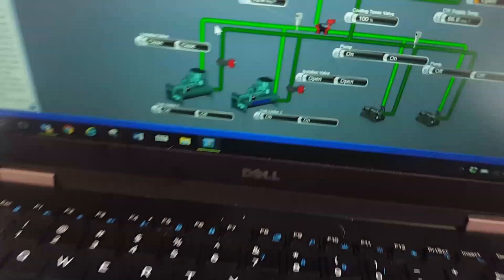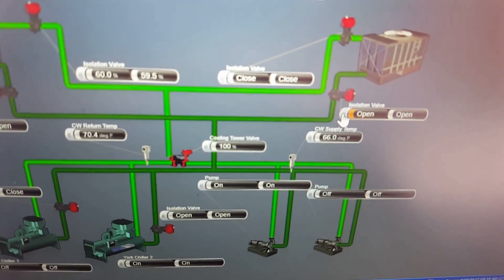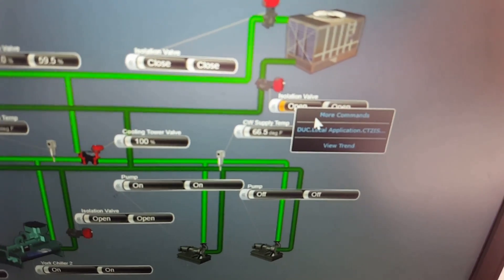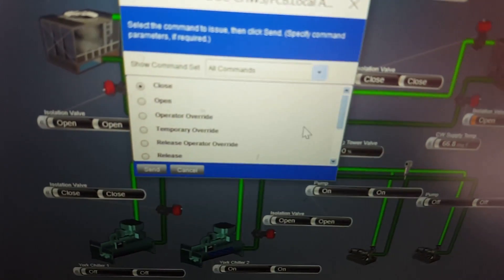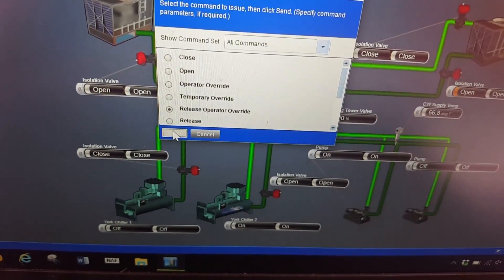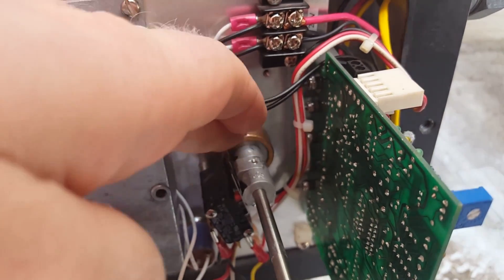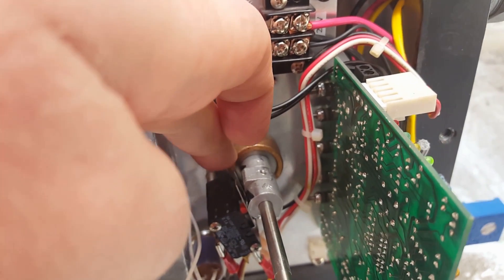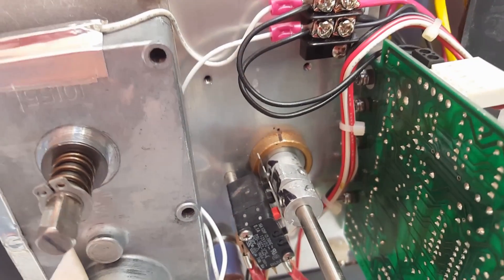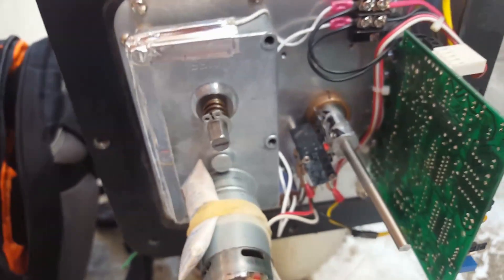What we're going to do now is actually take this valve back closed. I am going to right-click on my command point, more commands, and I've already got an override for open. So all I need to do is just release this override. You can see that the motor is running, and just to give you an indication of what happens — when I push this limit switch, it stops. So when I release it, it's going to continue to run until that cam actually makes that switch. And once the cam makes that switch, the valve will stop moving.